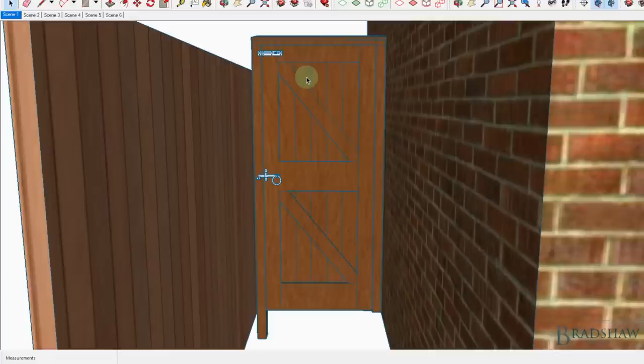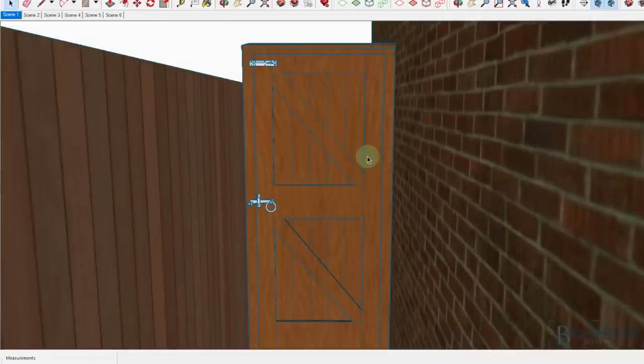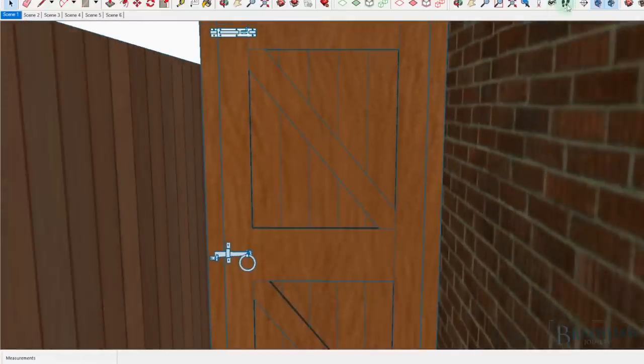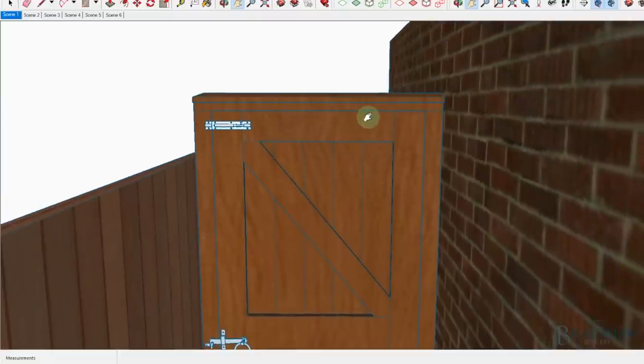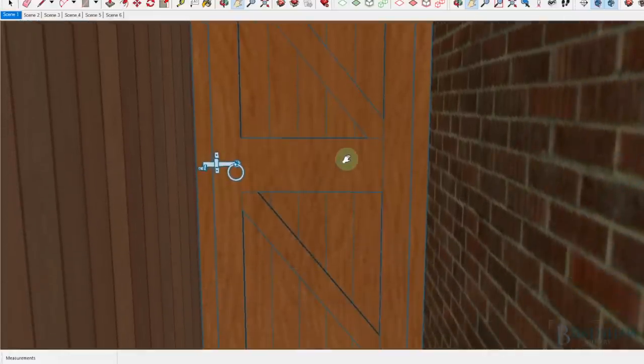So the dimensions of the door from the back here, style width is decided for us on the dividing of the boarding equally. I keep the head of the door the same width as the style, so they're always the same and run through around the door. I've found this to look the best over time. I always do my braces slightly narrower than the styles. It just looks a bit too chunky and a bit weird if they're the same width of the styles, but it's not the end of the world if they are. I've just found it's slightly more finesse if they're slightly thinner.